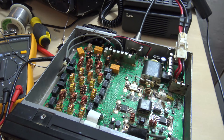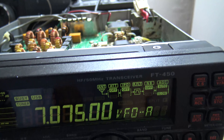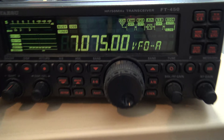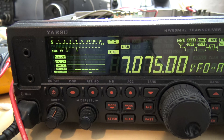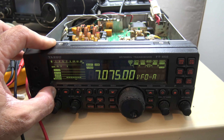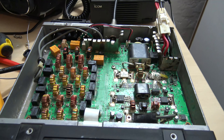To show you what this is doing, I'm going to turn this on. It receives, I've got it in a dummy load. When you hit the tune button nothing happens, you get an antenna blinking. You hit transmit, nothing's happening, and of course zero power output. My notion was this thing's not even switching into transmit, because if you had bad finals or whatever, you'd still see something — some sort of erratic voltage changing or whatever.